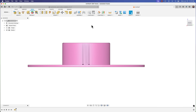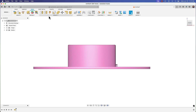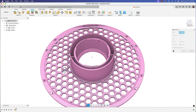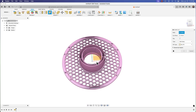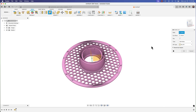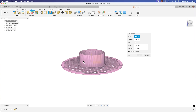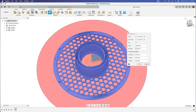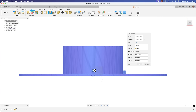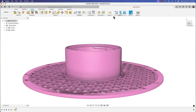Let's go to a front view. Go to Modify > Plane Cut. I'll use the origin plane as a reference — follow your dialog box, select the body first, then choose the plane cut. Let's select the XY plane and go back to a front view. I'll bring in the section analysis to make it a lot easier to see.